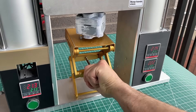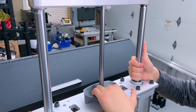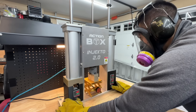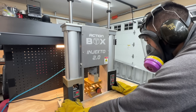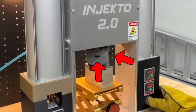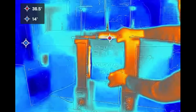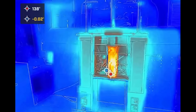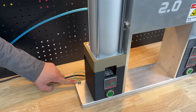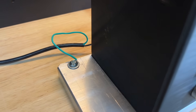As a safety reminder: we employ two injection switches to keep hands away from the powerful pinch point. Always use proper hand and face protection, as high pressure can make molds explode or shoot molten plastic toward the operator. The frame can also get hot to the touch over time and must be monitored and ventilated properly. Electrical grounding is key since the entire frame is metal — this is the responsibility of whoever sets up the electrical.